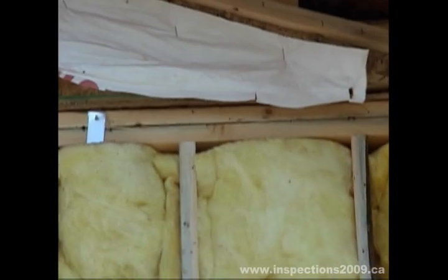There are no insulation stops. Looking at the top part of the attic, there should be a cardboard-type material to stop insulation from coming down — it is not present in this home. You can see all the air space and the insulation.